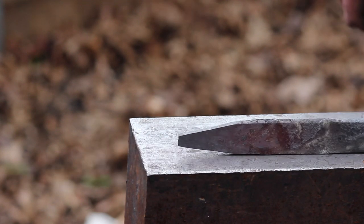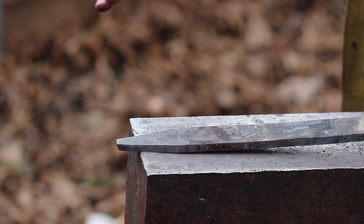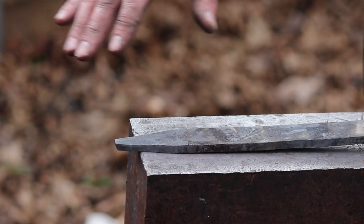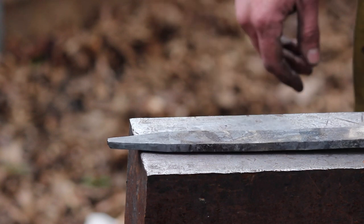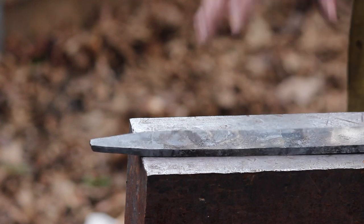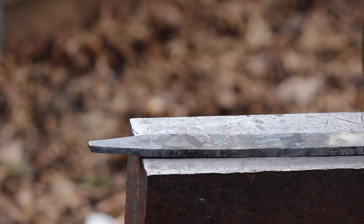Okay, I might call it good on this preform. So the next thing I'm gonna do here is we're gonna anneal the blade, or as much of the blade as I can. So basically we're just gonna heat up the temperature and just let it cool down naturally and let those embers die out on their own, and that'll keep this thing hot for a long time and let it cool real slowly. I'll come back tomorrow and I'll start putting in the edge bevels and forging the blade.